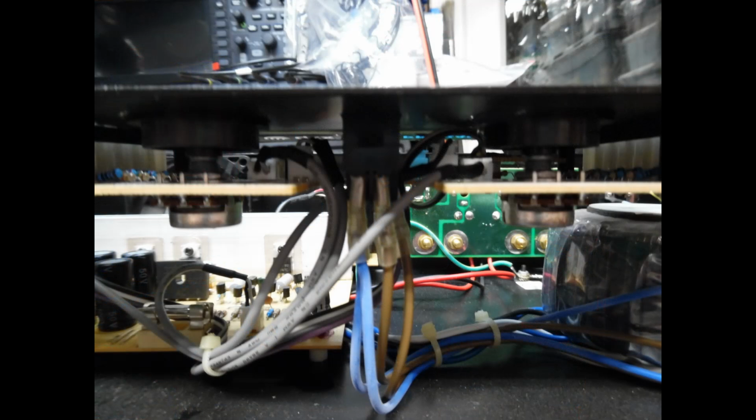And then what I'm showing here in the video is just the board removed, and you're looking from underneath. What I'd advise you to do is, often you'll find you get dust build-up, and it could be brought in via the cooling fan or just through the vent grills at the front. Always spray into there some high quality switch cleaner or contact cleaner, here we use De-Oxit, and then just rotate backwards and forwards those volume control potentiometers multiple times. And what you'll find is that you're rewarded then with a very clean operation.